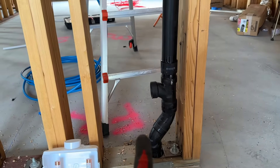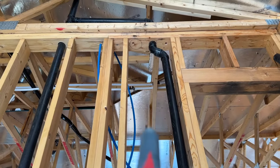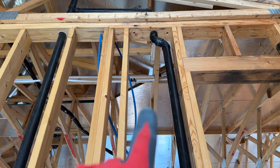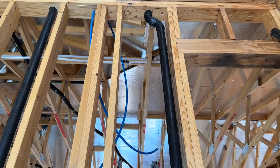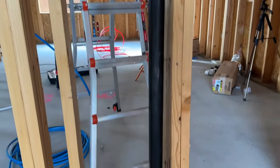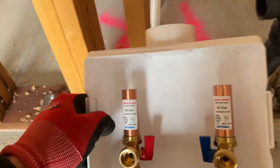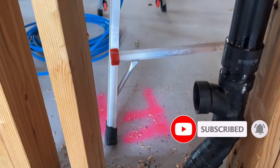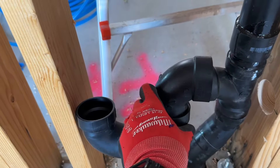I had to move the vent pipe over a little bit. You can see as it goes up here to the ceiling, we might have some clearance up there with a vent pipe that goes up through the ceiling for the dryer, just in case we want to do that if we don't have a self-drying unit. So I jogged the vent pipe over, and right here I needed this clearance because we're going to be using this box right here — I'll put a link for it in the video. We're going to mount this in the wall and I need that clearance there, and I also need the clearance so that this P-trap can sit in the wall properly.